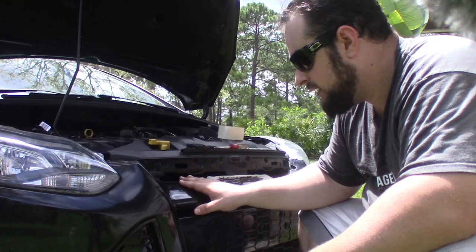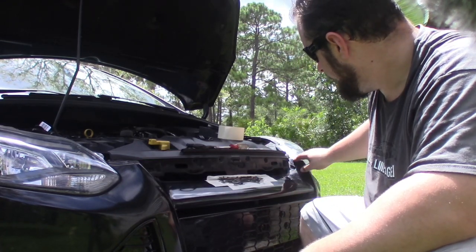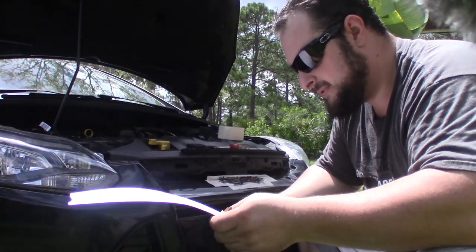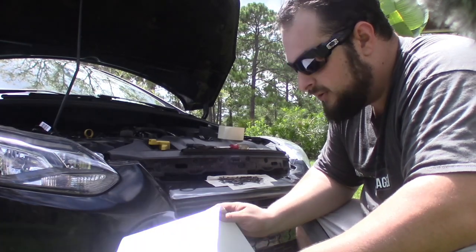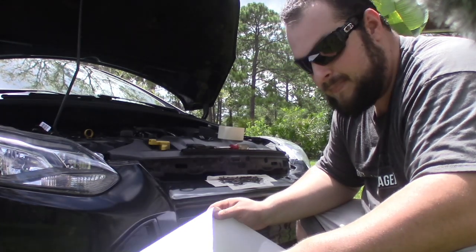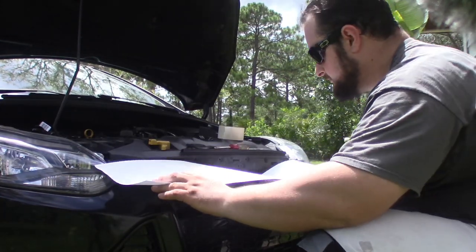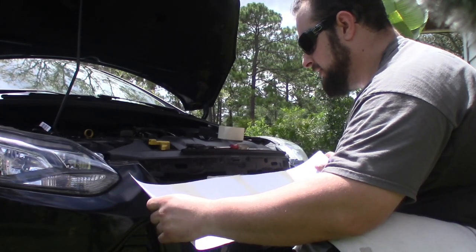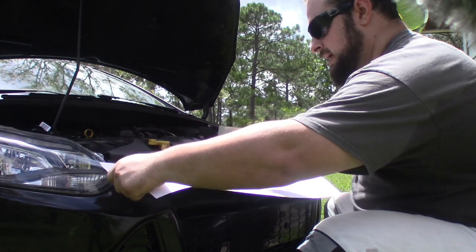So what I want to do is remake that. I went ahead and ordered some ABS plastic so I can make my own version. What I'll do is make a template out of cardstock paper first, and then once the ABS comes in — because I don't have it yet — I'll go ahead and cut it out, heat it up, and basically lay it down and tape it down. Until that happens, I'm going to go ahead and get started on this — as you can see, we're going to need to kind of shape it.